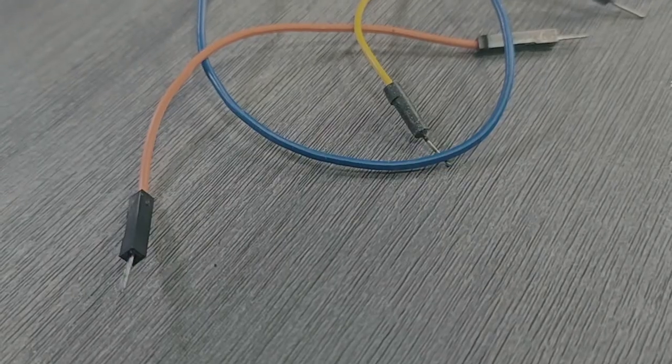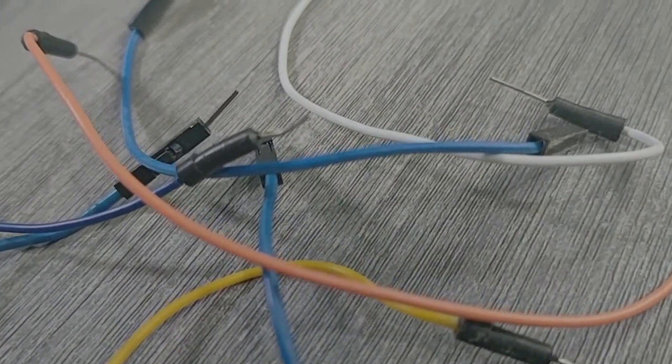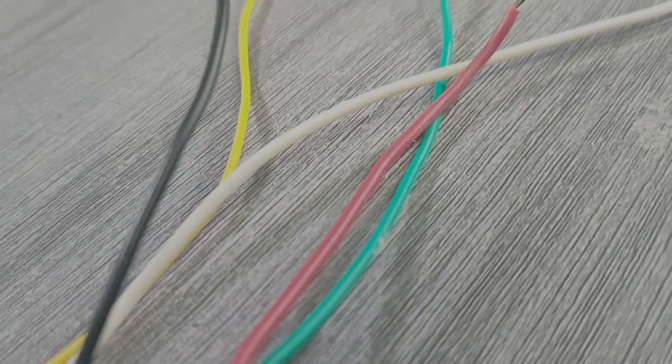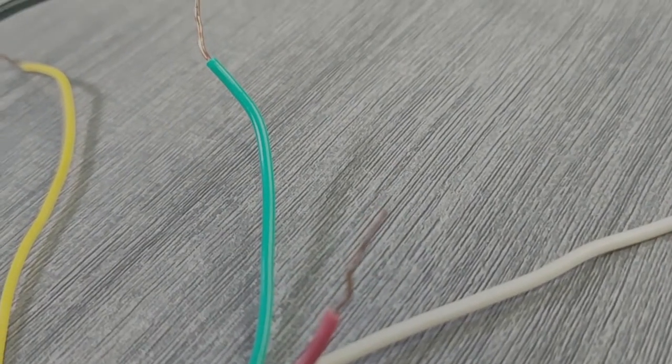In connecting components with the breadboard, you may need to use jumper wires. Jumper wires are wires that have stiff ends that are easy to push into the breadboard holes. You can also buy spools of solid core hookup wire and a pair of wire strippers and cut your own jumper wires. This is the best long-term option if you plan on doing lots of electronics projects because you can cut wires to the exact length you need and pick which colors you want. It is also much more cost-effective per length of wire. You also need to use the right wire gauge — 22 AWG, or American Wire Gauge, is the most common gauge used for breadboards.